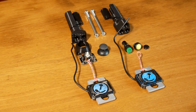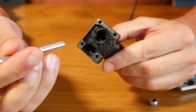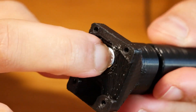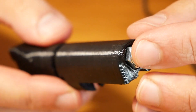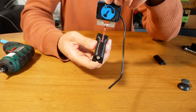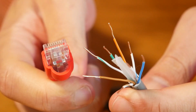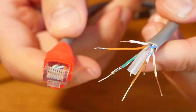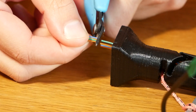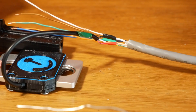Now it's time to start putting the handles together, and the joystick side is the more tricky one. The bolt goes through and ends up recessed, as well as the nyloc, so I don't have to tighten it very tight and it will stay in place, leaving enough space for your hands. I used network cable because it already has eight conductors inside — I actually needed nine for this side but cheated a little bit with ground, and that worked out.